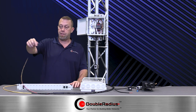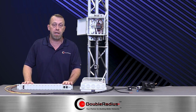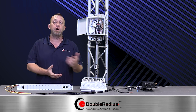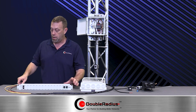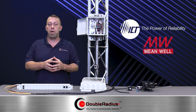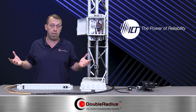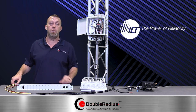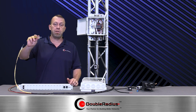On the ground side, we have 36 inches of cable play. You would run your DC lines into a DC surge protector on the ground to isolate static discharge or energy from lightning. You have your Transdector DC rack-mount solution here — this runs into it, then a jumper to your power supply, whether that's ICT, Mean Well, or whatever you like. I'm really excited about ICT's new DIN rail solution — that's perfect for this application, and they also have rack mounts. Then your fibers go straight to your switch.